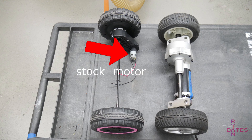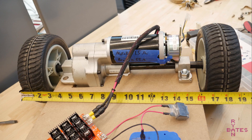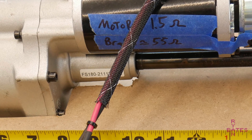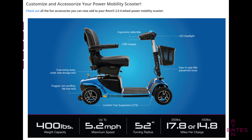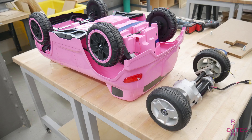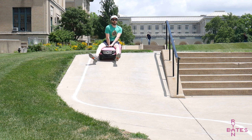The theoretical power output of this build is almost 1.4 horsepower. The specs for the upgraded motor and gearbox state it can handle 24 volts, but looking at the wire gauge, I'm going to bump that up to 40 volts using two cordless drill batteries. I can reasonably assume this won't melt anything because this motor's original purpose is to haul up to 400 pounds up a steep ramp at its traditional 24 volts. That gives us a top speed of about 7 to 8 miles per hour hauling 200 pounds.